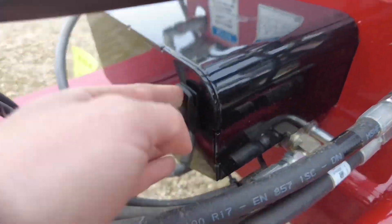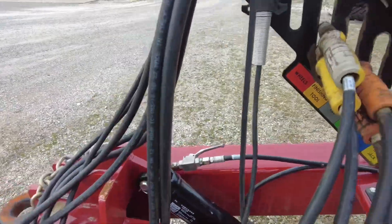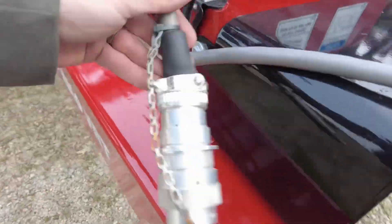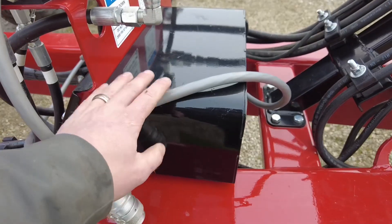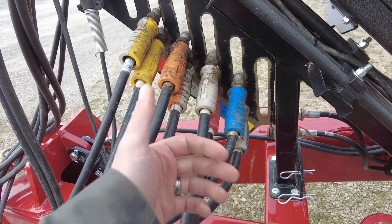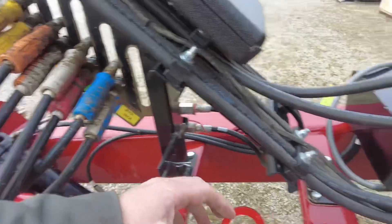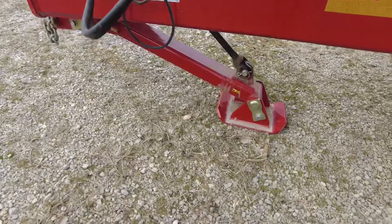This 30 has a box in the front with a rocker switch and a controller plug — this is the joystick option. Basically what we're doing is taking the adjustment from five hydraulics down to four when we go to the joystick. It allows you to have a handheld joystick up in the cab where you can control all functions — it's electric over hydraulic. Super handy, and there's a hydraulic jack on them as well.